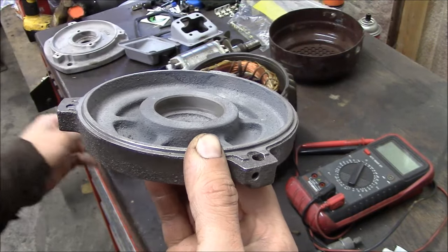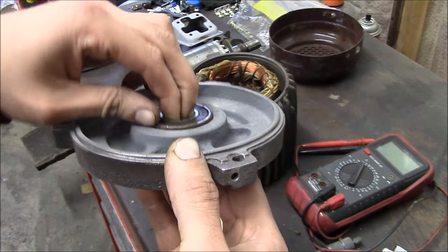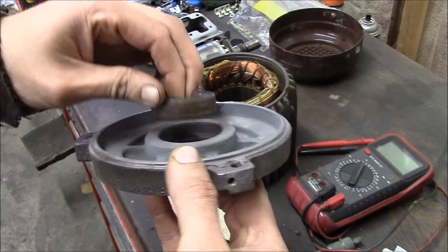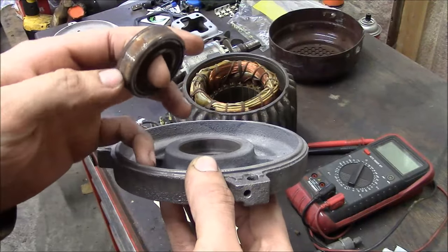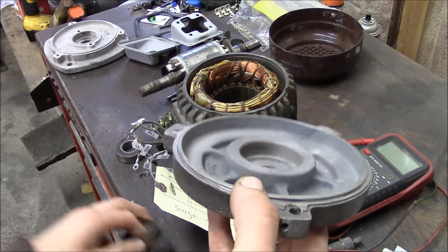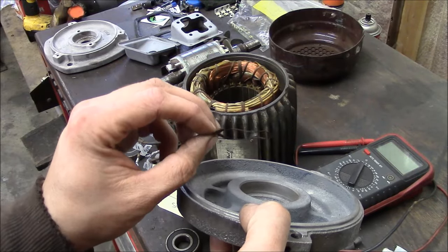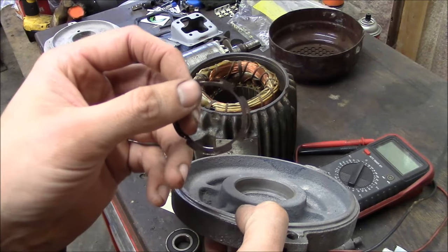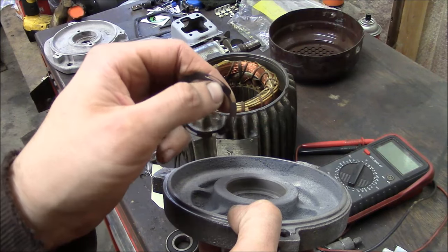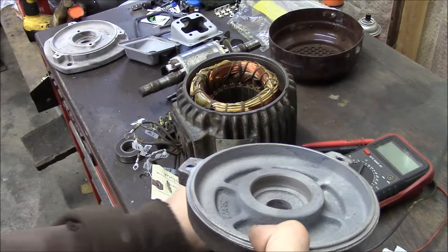That's the edge of a wear pattern. And yeah, this rear bearing is pretty loose inside that journal. So that's not right. Also, it looks to me like, well, for sure it's been spinning in the journal. I can tell it's been spinning because this is the wavy washer that preloads the rear bearing, and you can see the bearing has spun so much on this wavy washer, the outer race of the bearing actually wore through the wavy washer. So yeah, that's no good.